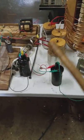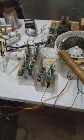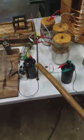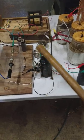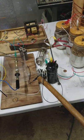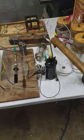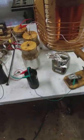These coils are what — normally like two or three thousand volts I think, maybe 10. I don't think they're made to produce that much at 12 volts. But we're putting 350 volts DC into them, at extremely low amperes because of the choking that's going on in the multiplier circuit. The coil shorting aspect — which is ironically right along the lines of how these coils are designed to operate, they're made for impulse currents — works really well. The series capacitance here is the only thing that allows it to operate. Without it, even though the spark will arc and short the coil when a straight DC field is applied, we don't get the surge of voltage in the secondary. These series capacitors also make the secondary side output even better.